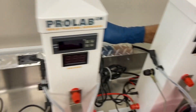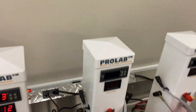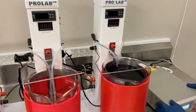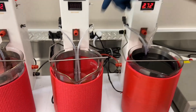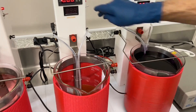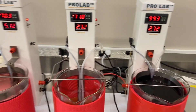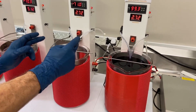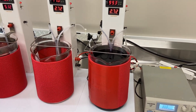We'll plug in the module, tighten them up. Flip them on — and if we added the nickel solution and turned it on, we can just unplug that for safety. We're ready to go. Now we could go through and do electro clean, tri-val activation, then put a bright nickel on, and then put the gold on the bright nickel. We would just have to set our appropriate rinse waters up.